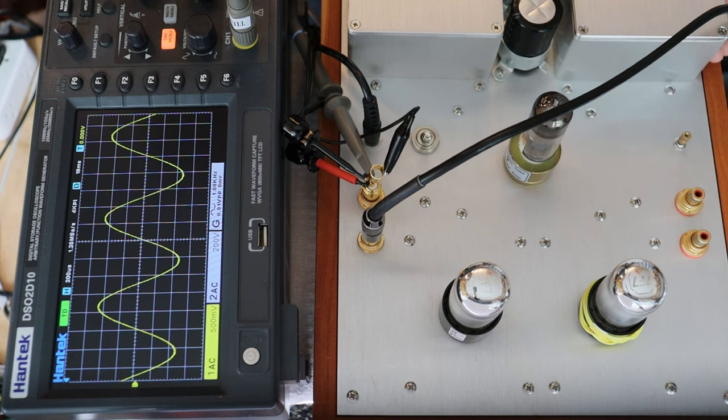So one of them has got a nice little elastic around it, and that's the one we deem to be too microphonic. And the other tube that matches it is actually as good as this type of tube gets. So it will ring, but it doesn't continue ringing. Not a microphonic tube.